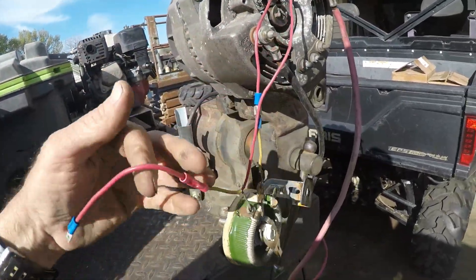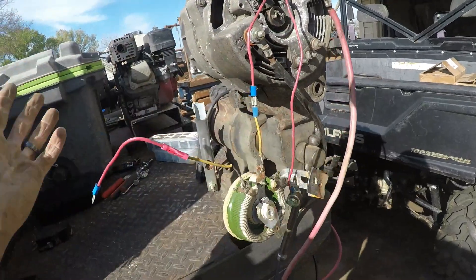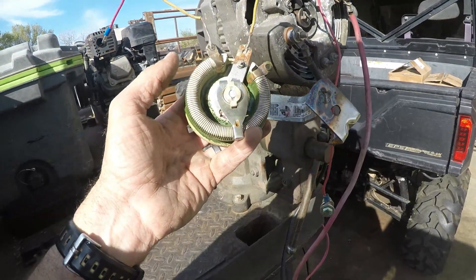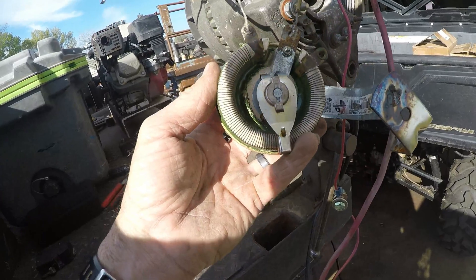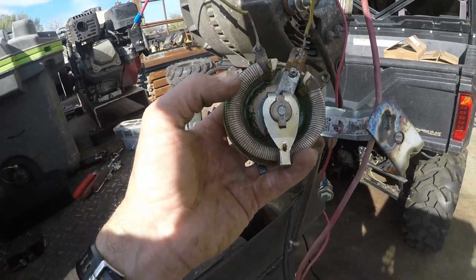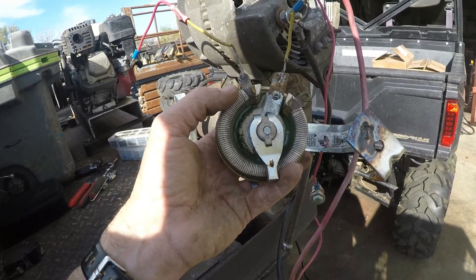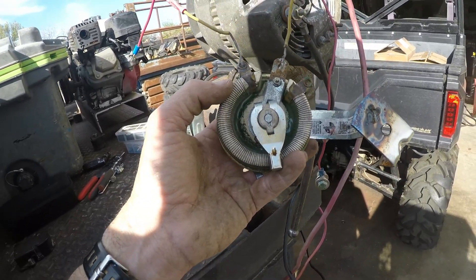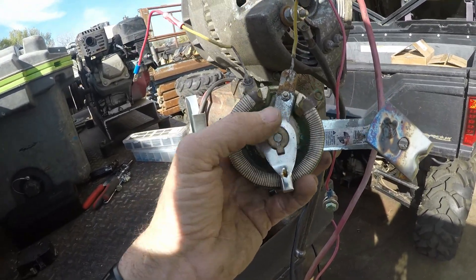If you have any questions — I really hate to just draw up a diagram because it's kind of crazy when you say you can hook this up either way and that up either way, but that's the honest-to-God truth. The only thing I noticed with this exact one I welded with full time: it didn't have a lot of adjustment. It was either all the way off or the lowest it went down to was still about 60 or 80 amps, and then full blown at 200 amps.